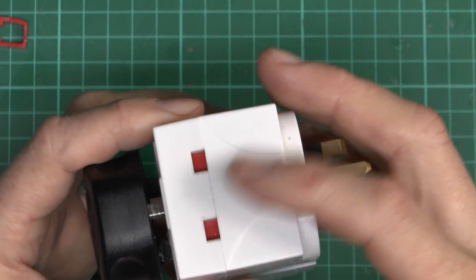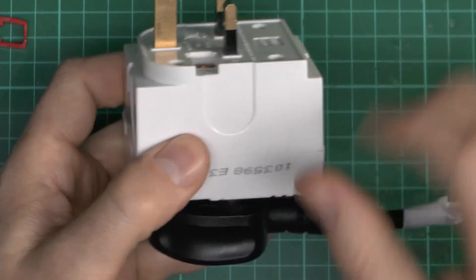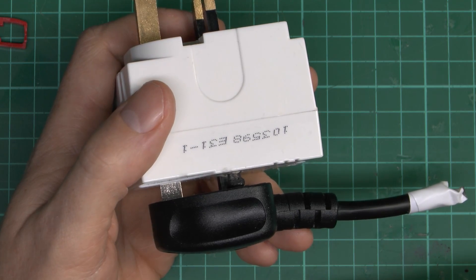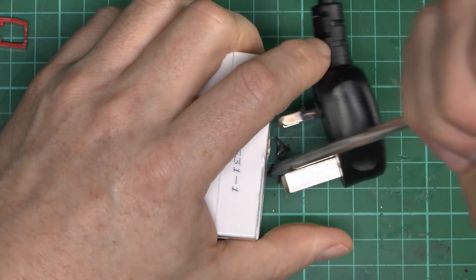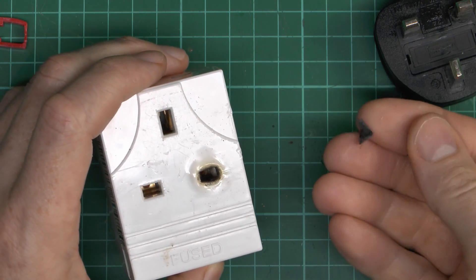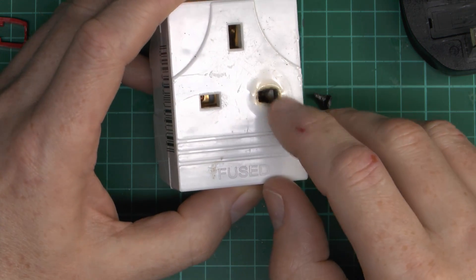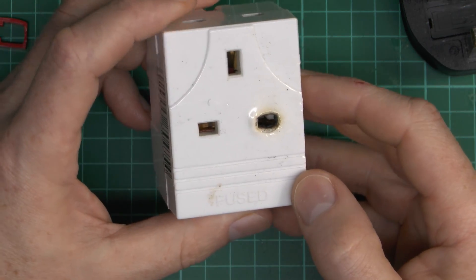The thing itself does have shutters, but of course that's required anyway. The problem here is almost certainly going to be caused by a loose connection, either due to the plug pin not fitting correctly or the socket contact not fitting correctly. Can we actually get this out? Some damage is going to be required. It does actually pry out - you can see bits of plastic have fallen away, and the hole shows the plastic has significantly deformed around it. This is the kind of plastic which actually melts and deforms - not really the best material to use for this.